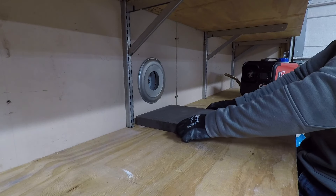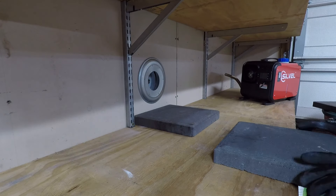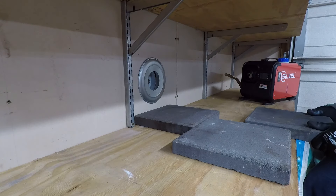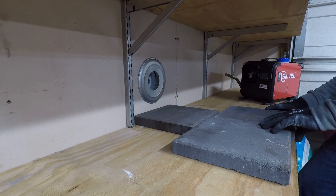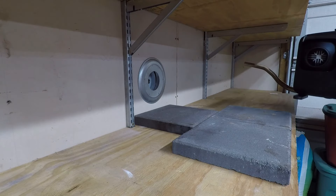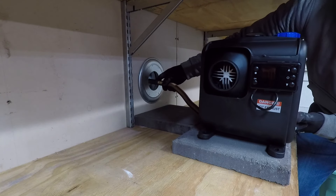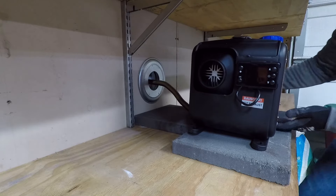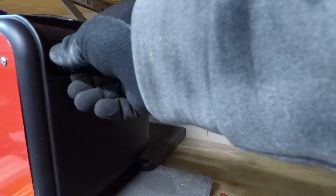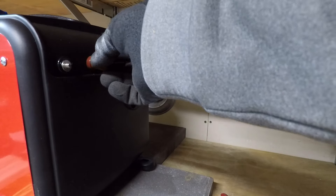Here you see me placing some landscaping stepping stones over the top of my shelving. The exhaust comes out of the bottom of these units and there's not a ton of clearance, so I didn't want any combustible materials close to that hot part of the exhaust. I spaced them out to protect that wood surface. I connected the pipe and ran the thing to test it, then came back later and put the hose clamp on nice and tight inside the wall so there shouldn't be any chance of leaking.